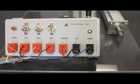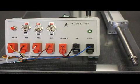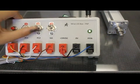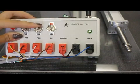We can now run the moves we just stored in the servo controller. Each time we want to run a move, we select a move with the PC inputs, wait at least 4 milliseconds, then send the 24-volt pulse to the CSTR input. The CSTR pulse should be at least 4 milliseconds long. To run Move 1, simply apply power to PC1 input and send the start pulse. We can see that the actuator makes a move with smooth acceleration and deceleration just like we programmed it to. Also note that the PFIN output comes on to indicate that the position is finished. With PC1 and PC2 off, the actuator will run Move 0 when we send the start pulse. Move 2 is relative or incremental, so the move starts from the current location and the actuator moves the same distance and direction every time.